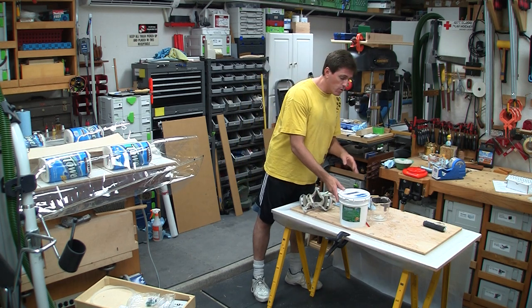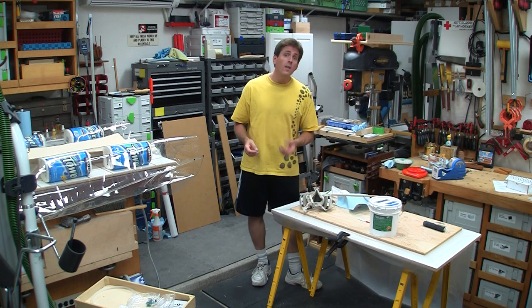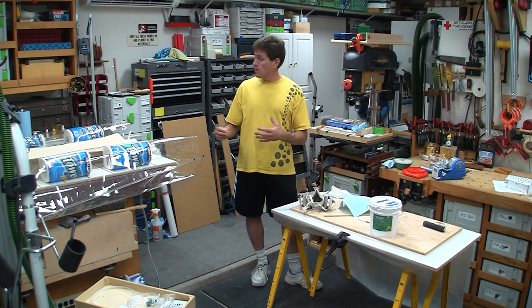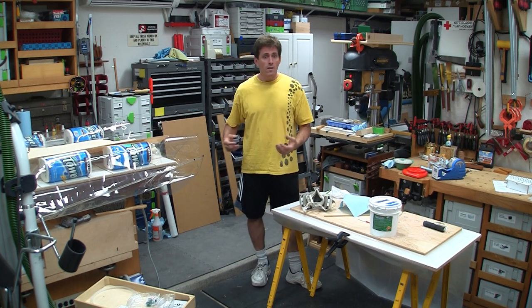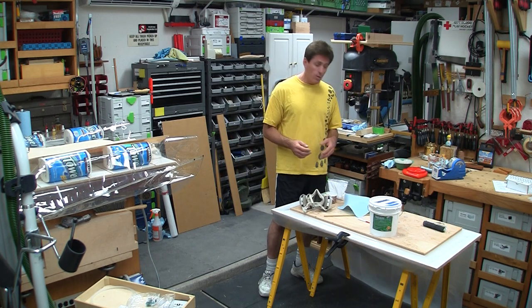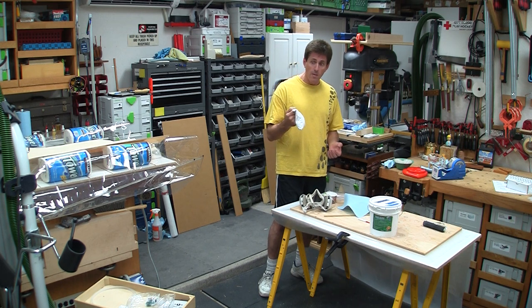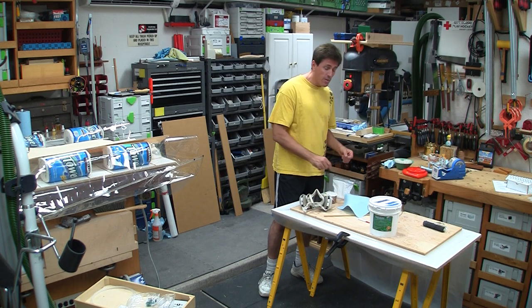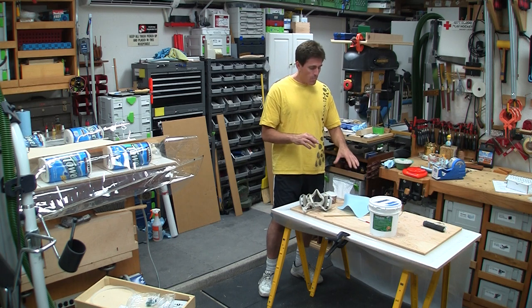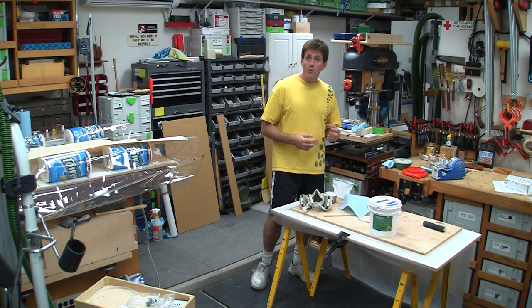Now, it turns out that this glue, when you mix it up, is going to tend to be more of a brownish glue, so it's going to look a little like a light walnut. The problem is I'm using a curly maple, so if there are any voids in here or any glue squeeze-through that comes through the veneer, it's going to look bad. To lighten up the color of the glue, we're going to use UltraCat Lightener. Basically, it's a white pigment, I'm assuming a titanium pigment, and it's inert. You mix it with a little bit of water, and once it's blended, you add very, very little of it to the glue, because it goes a long way, to lighten it so that it's just a tone less than the curly maple. I don't really want any of the bleed-through to be visible.